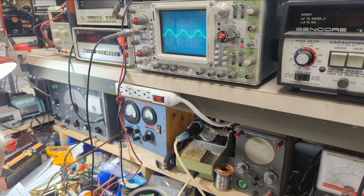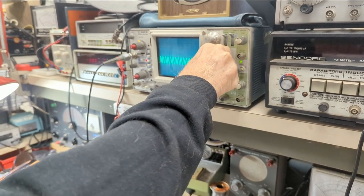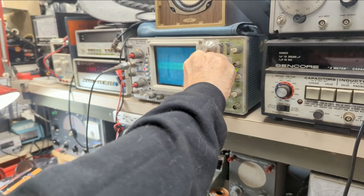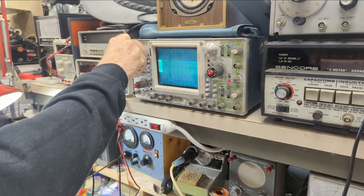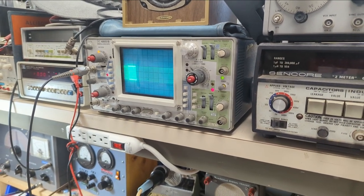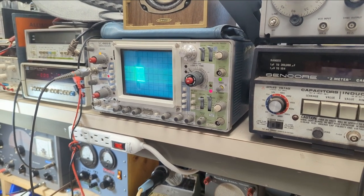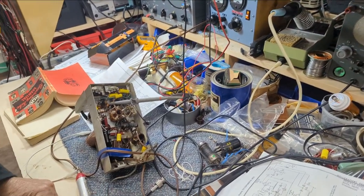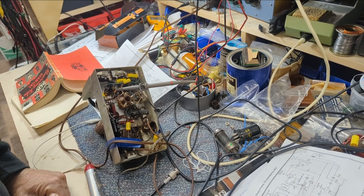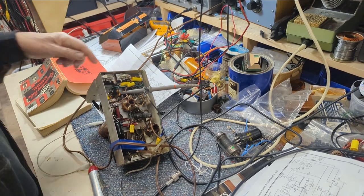Hello. Oh, what a frequency. Wait a minute. Let's go back to... It did react a little bit. Yeah, that's 300 kilohertz. You're looking at the RF. There we go. Hello? Do you see anything? No, it's moving up a little bit. 2% modulation. All right. No, the envelope is not really... See, there's the problem right there. That stage is almost driven to cutoff. It's because too much voltage off the batteries. Yeah, we're driving the tube to cutoff.